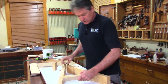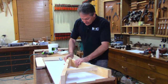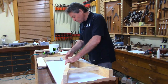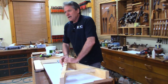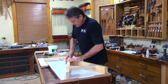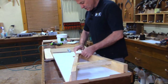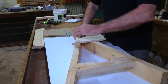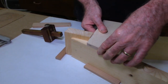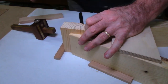I'm going to take the clamps off and set it back in my jig. Now we've got our top rail in position. I'm going to put a little gusset up here on the outside — this will be glued on. It references and indexes for the bottom and gives you a lot of strength across the top. Because I may want to replace this rail, the rail is going to get screwed in, but this gusset will sit right at the bottom of that bird's mouth as well. I'm going to mark it with a pencil over here and hit it with the band saw to cut it off.